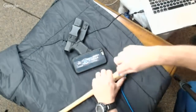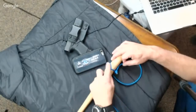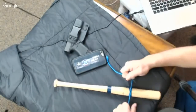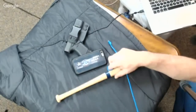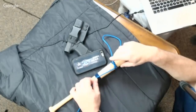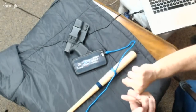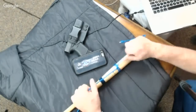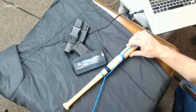So I go around, and I make the X. And then I always tell everybody to shoot for the X. So that just basically means I go under here, shoot for the X. All right. Now, when you use this rope, this is the end of a rope. And then this is the long end of the rope going up to the building. You can tell if you tied it right when you pull it. Basically, it's like when you're wrapping a present on the bottom, it goes across and around and goes the other way right here. So like this rope goes around and underneath, and this one goes this way. So if I wanted to hoist this up to a building, you do a clove hitch and one or two half hitches. So I would just throw a couple of these bad eggs in here real quick.